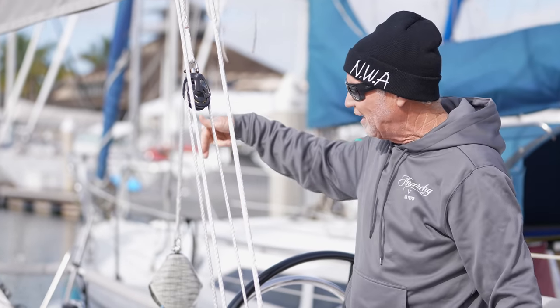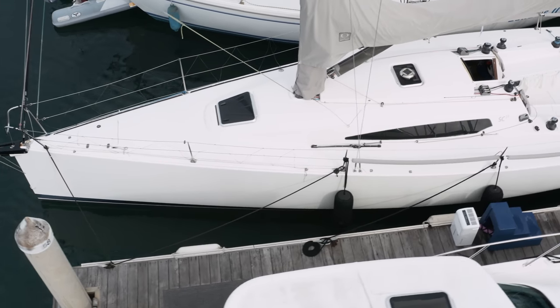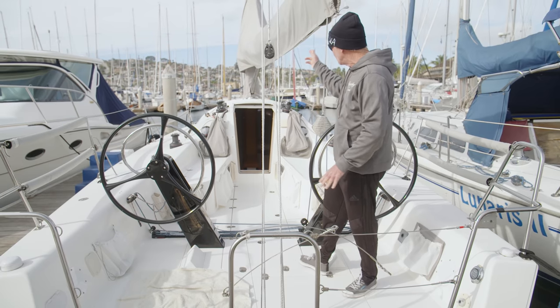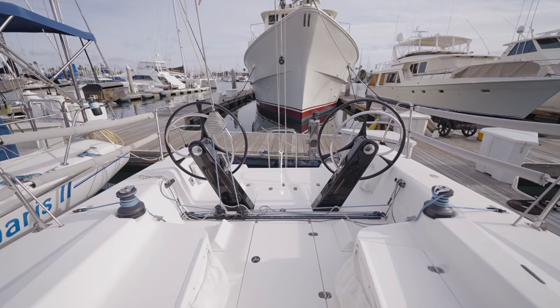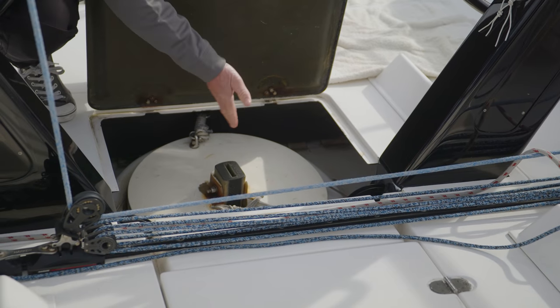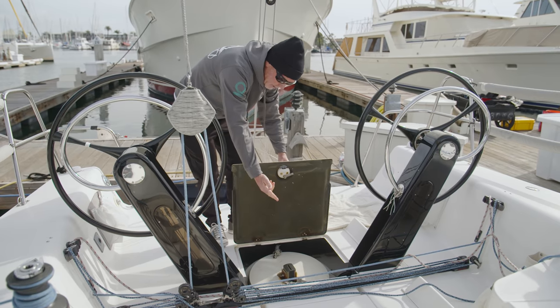You wouldn't want to trail a boat this big with a seven-and-a-half-foot keel fixed — the boat would be way up in the air. This particular boat was modified: they put in a permanent rudder, got rid of the cassette, added different rudder bearings, and made the keel fixed. They also added a kelp cutter. You'll notice this little hatch here — open it up and there's the rudder head, giving you nice access to the quadrant. That was originally done so you could pull the rudder up, because the lifting rudder and lifting keel is absolutely what that hatch is for.